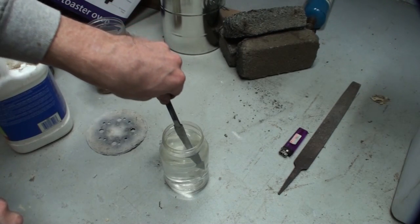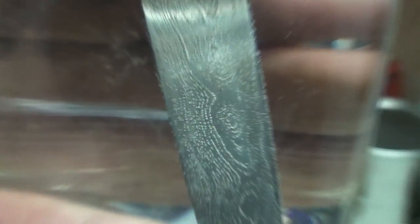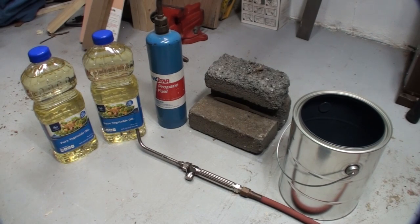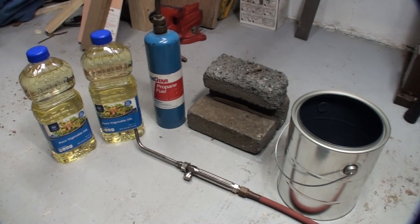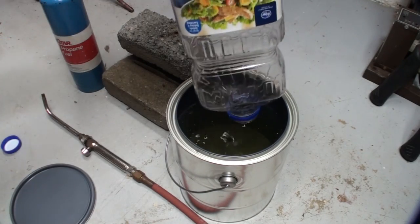At this point I wanted to do a test etching just to see what 600 grit would look like once etched, and I was pretty happy with the results. I used muriatic acid instead of ferric chloride, which worked fine — it just wasn't quite as gray as you'd get with ferric chloride.